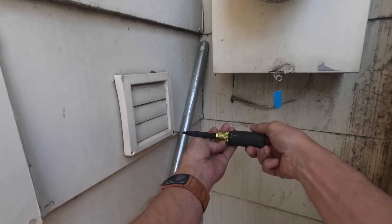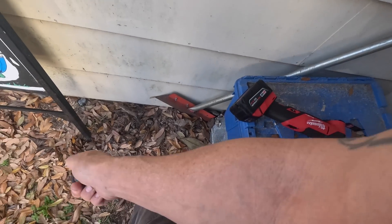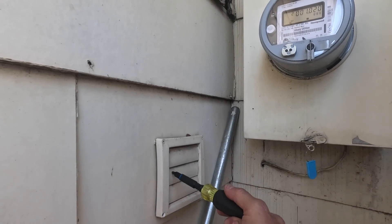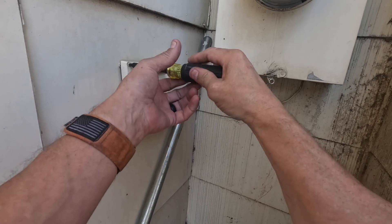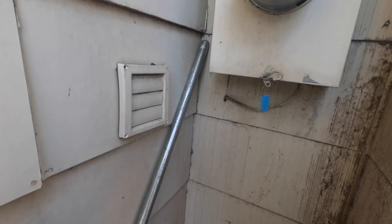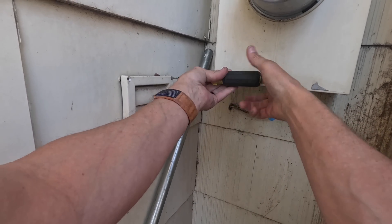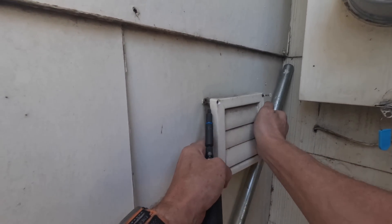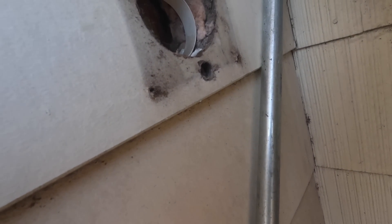As I'm out here working on this day-by-day mini split install, here's my electrical disconnect. We're going to put a condenser right here. We've got three line sets that need to penetrate the wall. That right there is not really a good option, so we're going to use this instead. This isn't being used — the space behind this is just storage space, there's no dryer there.